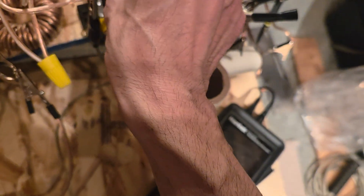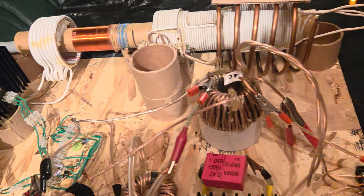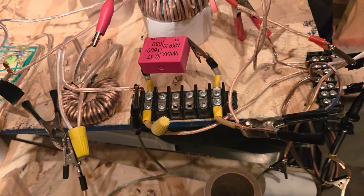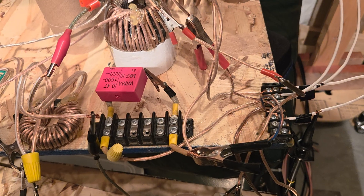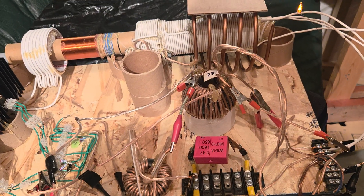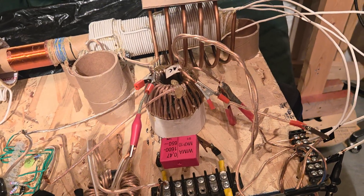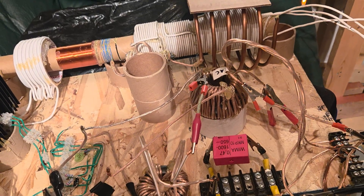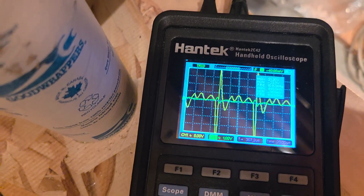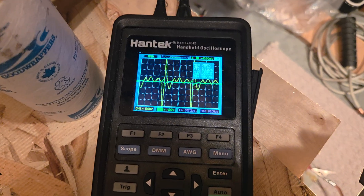So that's actually what I was tuning for. Once the distance and coils were set and everything, the bifilar capacitor — just grabbing across the capacitor and watching for coincidentally around 15 kilohertz. On one of the Russian not-translated videos, I did translate the captions to English, and he was saying that 15 kilohertz was what he was running on the output. And so when I turn off Tesla here — 15.7, 15.8 kilohertz. Incredible. This is bang on what Russland was describing.